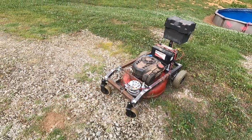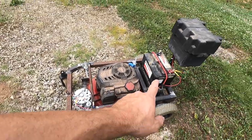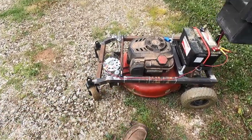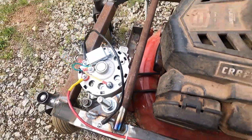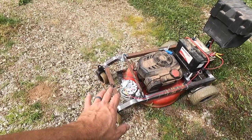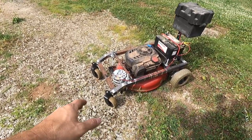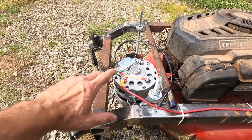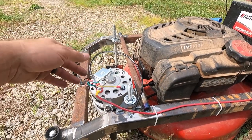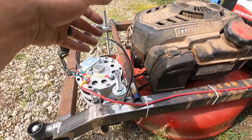If I build a nicer one I definitely want electric start from the remote and an alternator to keep the battery charged. This mower was self-propelled at the front wheels so I had the belt already there. I do have this alternator running backwards but it's still charging. This is a clockwise alternator — I think 95% of them are. I should have ordered a one-wire alternator but didn't know — just figuring it out as I go.